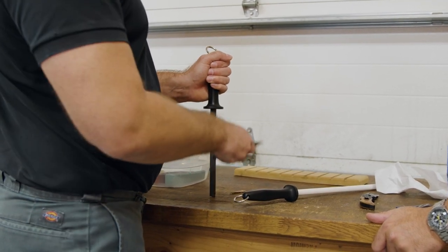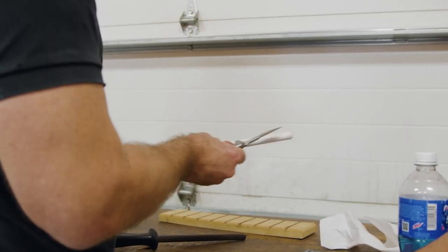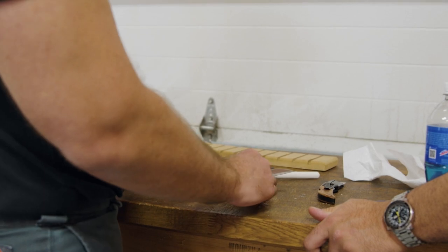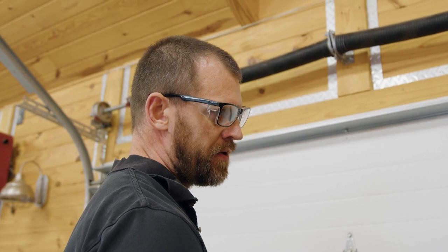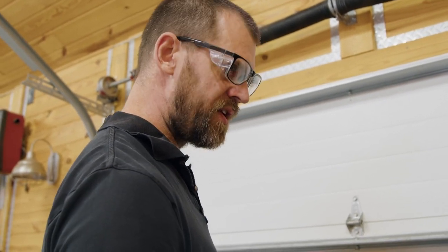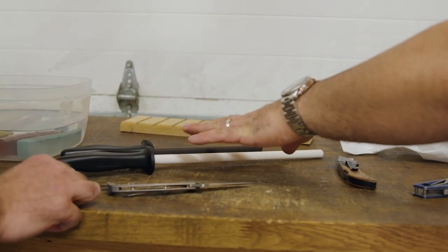Is there a reason to have both honing rods? One is for honing and one is if you need to really grind down on it. If you've got a chip or ding, remove it with as aggressive a stone as you can, because doing that with a 1000-grit stone takes hours. If you're just touching the edge up and it's still sharp but needs a bit more, use the high-finishing stone — it goes 1000, 2000, 3000, 4000 grit.